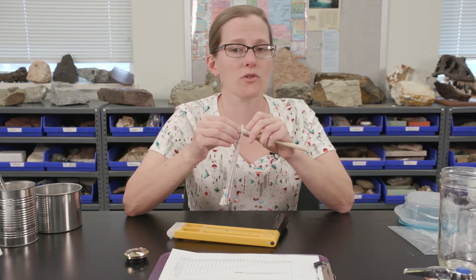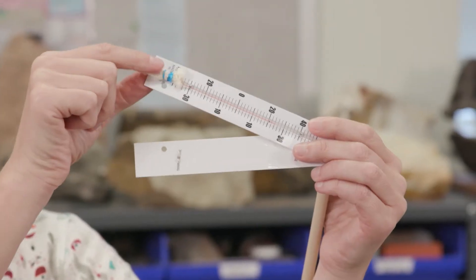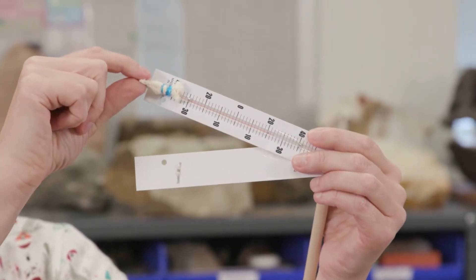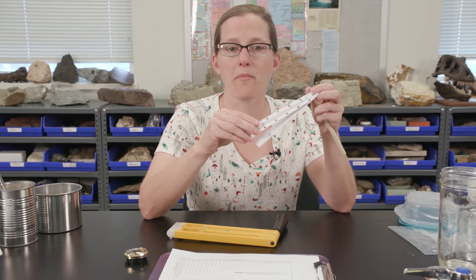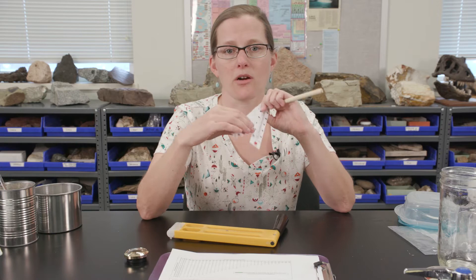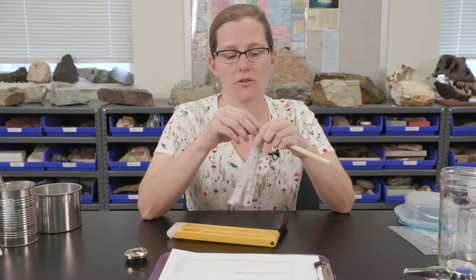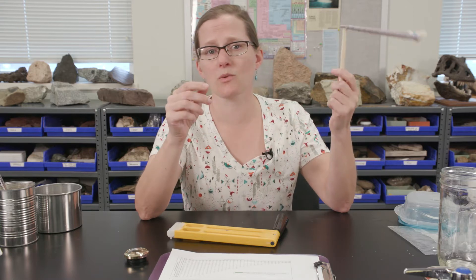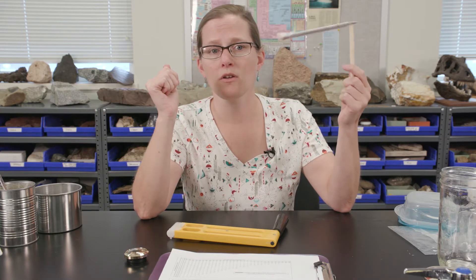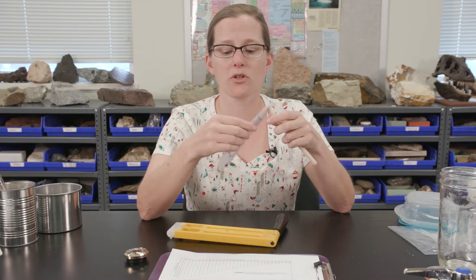To start, choose your locations. Then wet the cotton on your psychrometer, which is on one of the two thermometers. This will be your wet bulb or TW temperature. The other thermometer will be your dry bulb or TA, which is also the air temperature. You will then swing the psychrometer around for one to three minutes and then record the temperature of the two thermometers right away.